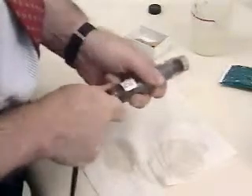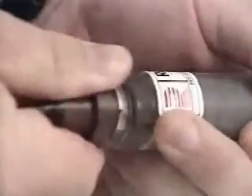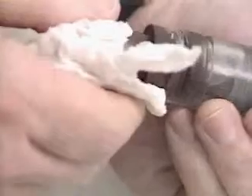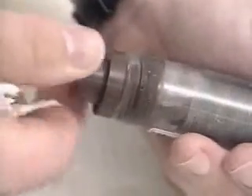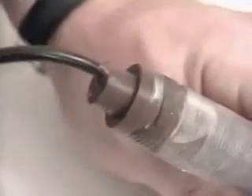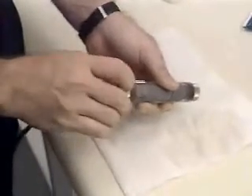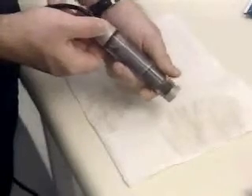Unless the sensor will be used in a pressurized application, it is desirable to trap a small quantity of air inside the sensor. When held at the angle you see here, an air bubble that is roughly the size of a quarter should be trapped inside the sensor. With the vent port facing upward, excess air can be vented from the sensor. Once the proper sized air bubble is achieved, rotate the vent port down so that the electrolyte is vented while the two pieces are completely joined. Be sure to align the keyway in the canister with the body. Do not force the two parts together suddenly or the membrane may balloon. Once the two parts are completely joined, tighten the retaining cap by hand. Once the sensor is completely assembled, this is roughly the size of the air bubble that is most desirable.